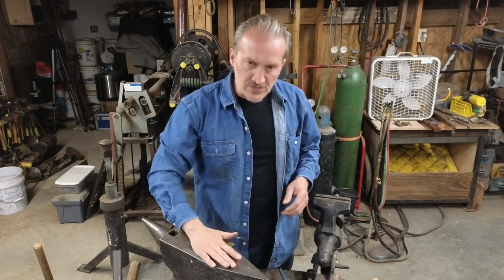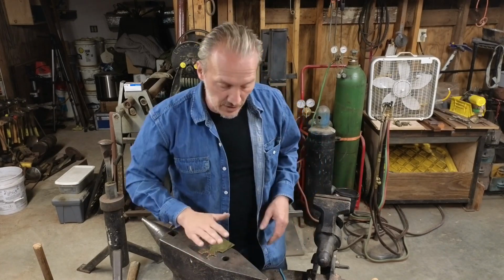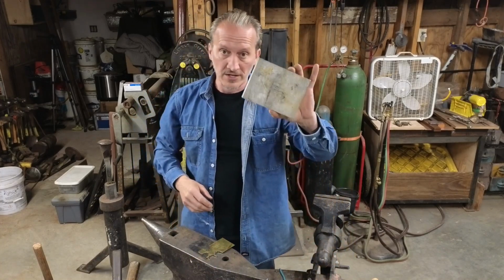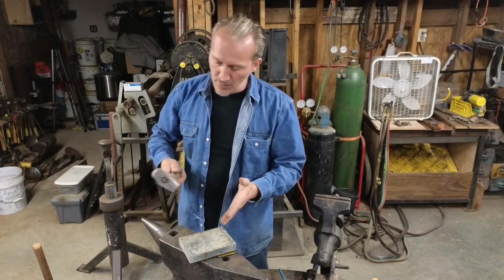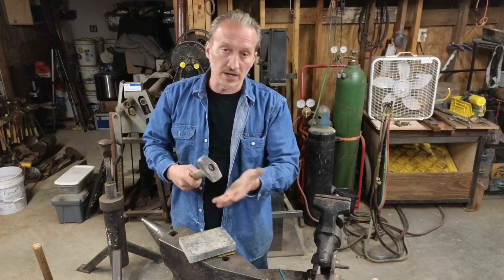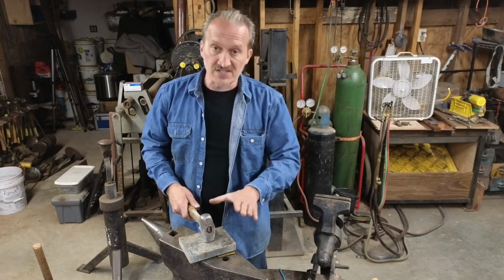When I first saw these, you had to have a hydraulic press, and I was like, these are small. Do you really need a hydraulic press? I discovered, no, you don't. It can make it easier, especially if you're doing a larger die, but this is just a block of aluminum, my anvil. You could potentially do it with a hammer, but you run the risk of striking unevenly. You could deform your die, break it, damage it, or warp it. So I found this does work.